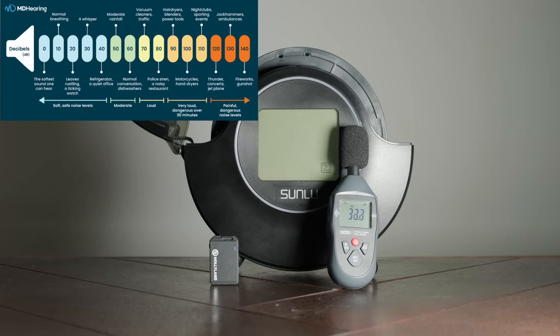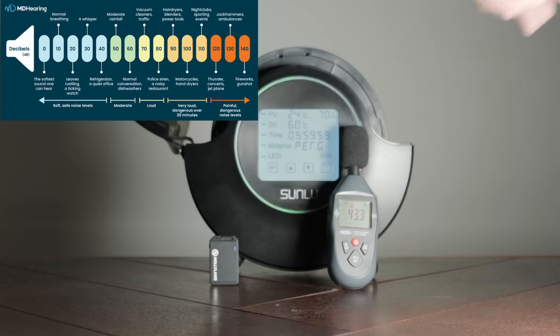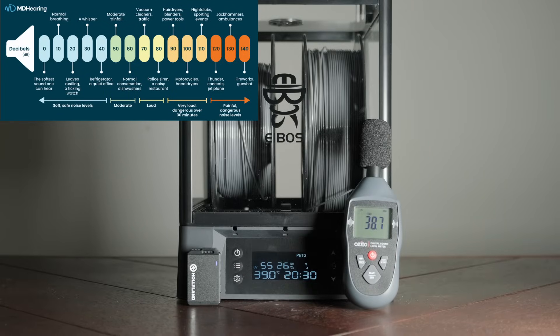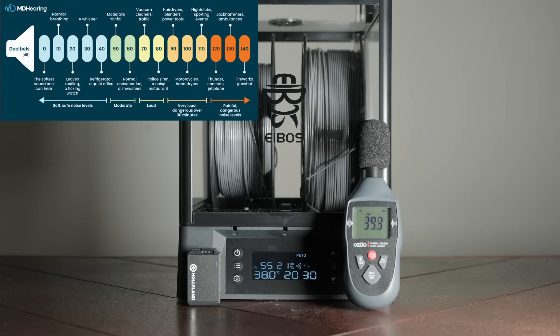Then there's the sound — I was actually pretty surprised. When I turned on the S2, the sound was averaging about 49 decibels with the lid open, and 48 with it closed. When I turned on the Polyphemus, the sound was averaging about 10 decibels quieter at 38 with the fans on low. Then I cranked the fans to full, which made it one whole decibel louder. Then I turned on the motor, which peaked the audio at around 42 decibels — still quieter than the S2, even with the motor, rotating spools, and extra fans.